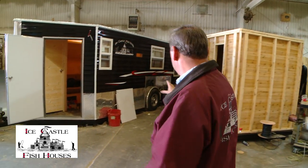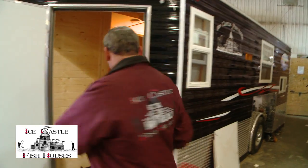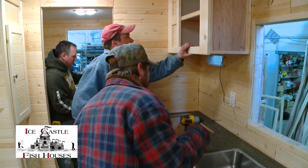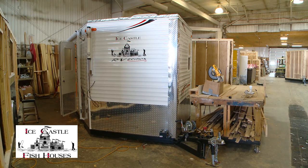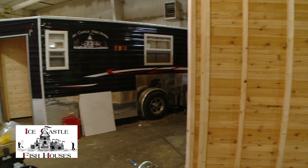These corners get put on last. The windows go in and everything gets trimmed out. This one here will be done in another hour or so and then pulled out and completed. All the walls are all screwed together, and all the paneling on the ceilings is all glued and nailed. The roofs are a one-piece galvanized metal roof. We put a plastic vapor barrier down first, then a blanket of R7 insulation over that, and then the metal roof rolls out over that. It's a one-piece roof with seams, but they're galvanized right from the factory. We've never had any problems with our roofs.